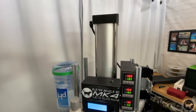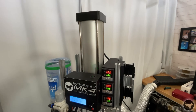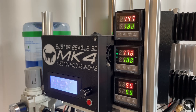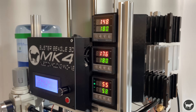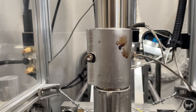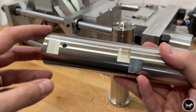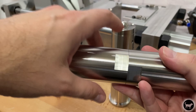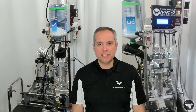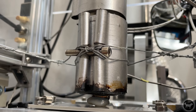Going from the top down: first we have the SC100 by 300 pneumatic cylinder sticking out of the top of the machine to push the plastic through the chamber. Next to that is a new enclosure for the PID controllers — I'm now running three of them. The top PID controller runs the top band heater. Each chamber extension has a thermocouple hole, so you're able to create heating zones. The middle PID controller controls the band heater closest to the nozzle.